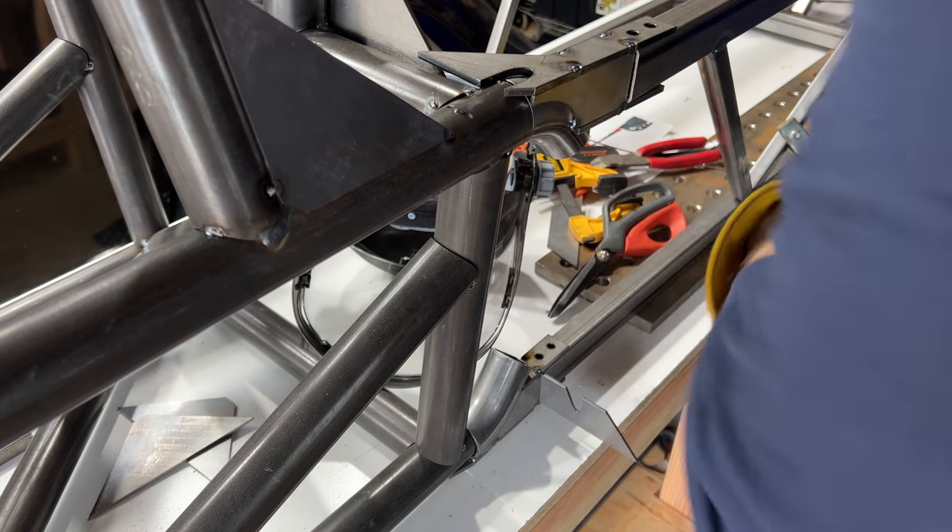This thing here looks like it was specifically engineered to be some sort of lightweight load-transmitting structure. It's not — I just thought it looked cool. Bolted to the back of this will be the tail, which will hold the parachutes and have the exhaust pipe plumbed out the back of the car. The tail is sort of like the fins of a dart — when you throw a dart, the pointy end stays forward because the center of mass is up front and the aerodynamics happen at the back. This is the same with airplanes — that's why the stabilizers are way out in the back. This is essentially the vertical stabilizer for my car; that's why it's so long. I don't need a horizontal stabilizer because, assuming everything goes well, I will only be moving in two dimensions — really just one. I might need to add a fin back here for more stability; I'd rather not, but we'll do some engineering and see what happens.